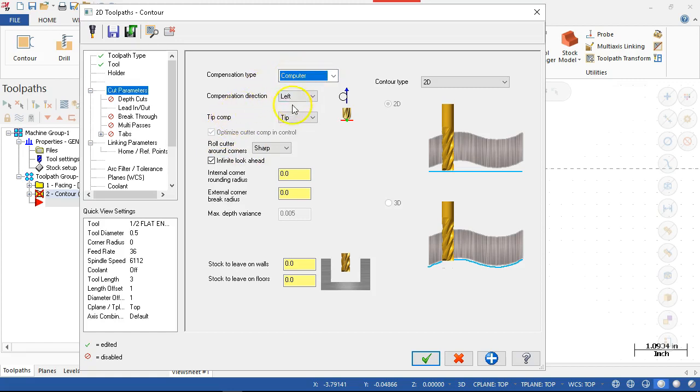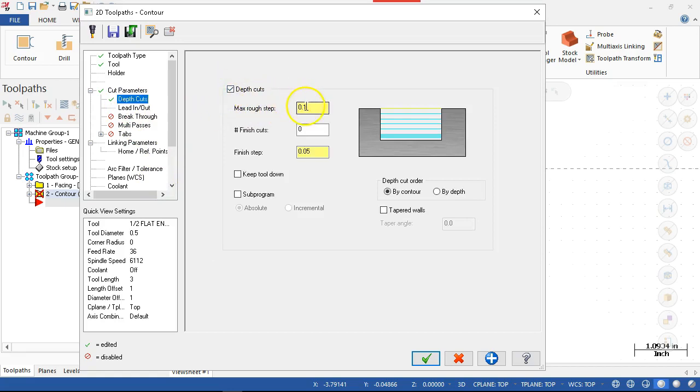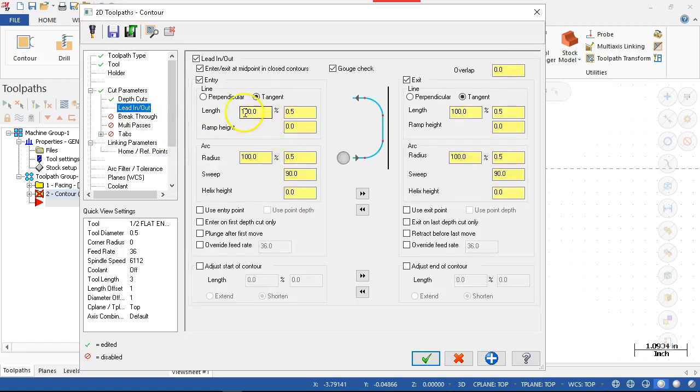All right, so I'll stay in computer. This is going to be the roughing pass, so stock to leave on the walls. We'll leave about 10 thousandths for coming back and cleaning up. Depth cuts, we said we're going to take 3/4 of the diameter, so 0.375. And not worried about finish, we can keep the tool down, which will, in most cases, from the lead in to the lead out, not do a full retract. We do want quite a bit, but probably not that much. So let's go to the radius 0.25, and the arc of 0.25, and see what that looks like on the preview. Maybe drop that down to 45